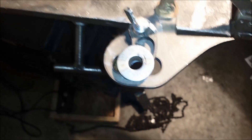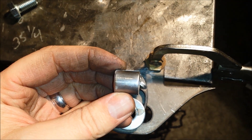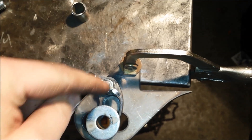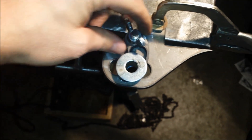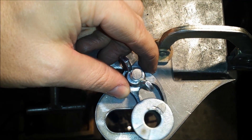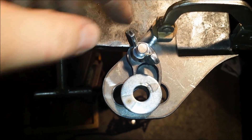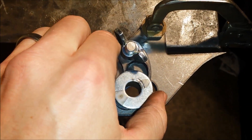Here's my adjustable bushing. I took one of these steel bushings and tacked a washer onto it. It rests down within here and this is adjustable — I don't want to touch it because it's probably hot from welding, but it is adjustable back and forth. Over a short distance you can't see it moving much, but it does actually move up and down within this arch.